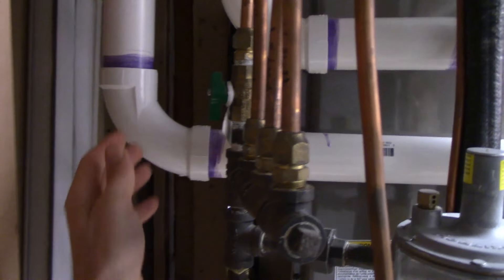But for gas fireplaces, there is an exception in the code that says you don't need to have the valve located in the same room — it might be located somewhere else. On my house, I have a shutoff valve down in the basement and another valve located inside the fireplace area, so I'll make sure that both of those valves are on. That's step number one.